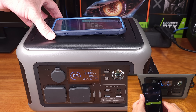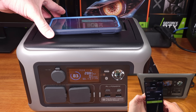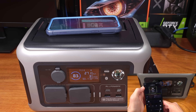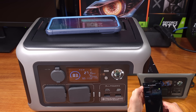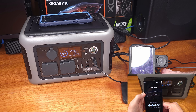Lithium iron phosphate batteries have very good endurance in terms of recharges. Allpowers rates this unit at being able to recharge at least 3,500 times, and the BMS — the battery management system — will automatically maintain the cells and charge and discharge them as needed to allow the system to function for a very long time.